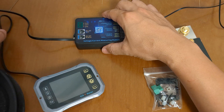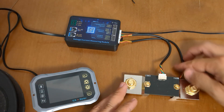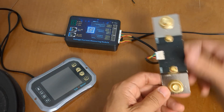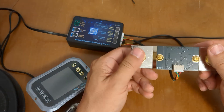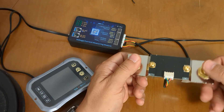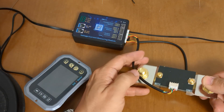That's it. From now on it's just a matter of connecting this to the negative port of the battery. It says right there: load and battery. So the battery would go on this side, and the inverter or charge controller will go on this side — the negative, which would normally just attach directly to the negative post.